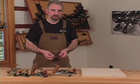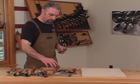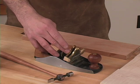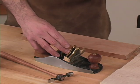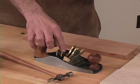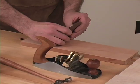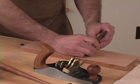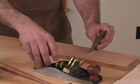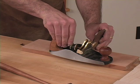With the blade sharp and ready to work, we need to insert it back into the tool. Both the 112 and the 212 have an adjustable angle frog, so you can position the blade at any angle you like. You change the angle by adjusting these 2 spin wheels. To determine the angle that I want to set the frog at, I'll run the blade like I would a card scraper on a test block. There'll be an angle where it feels good. That's the angle I want to match with the frog.